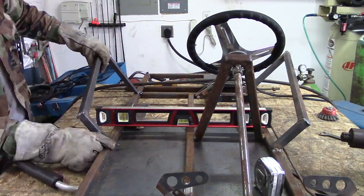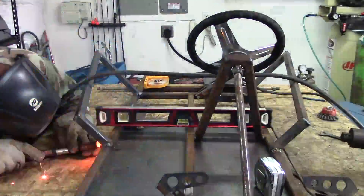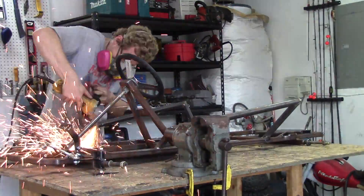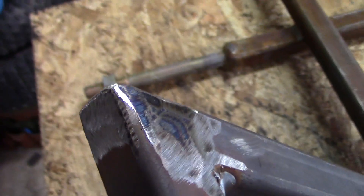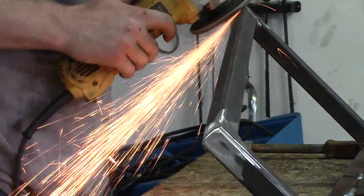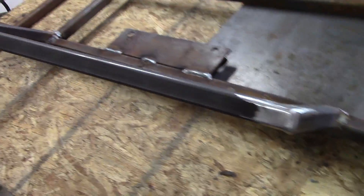Careful, it's hot. Get it all lined up on the go-kart, tack weld in the four corners first, then fully weld all the way around. You'll notice spot welding to fill a large gap there, and then take your angle grinder and grind down the welds. If there's any sharp edges, grind them down initially, then take the sanding disc for your angle grinder and you can polish up the weld to make it look smooth and uniform when you're all finished.